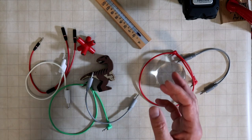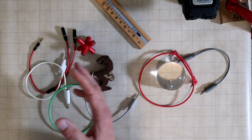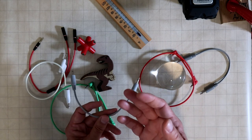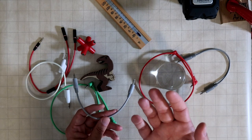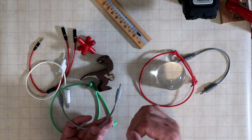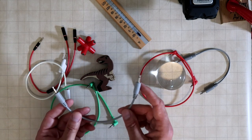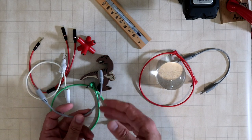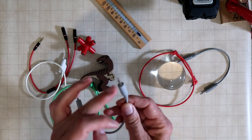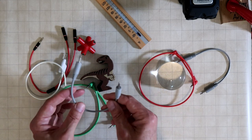This co-grounding on the sleeve is also important in audio cables — it allows us to hook gear from one place to another, whether that's an audio signal to a mixer or from one modular pod to a semi-modular synth. The signal on the tip conductor can be audio signals, modulation signals (time-varying voltage or control voltage), or things like triggers and gates. Basically almost anything can be sent through this type of cable or the three-conductor version. We'll see it in MIDI and in audio, but not in power, since the exposed conductor makes it unsuitable for power applications.